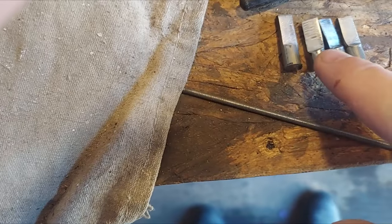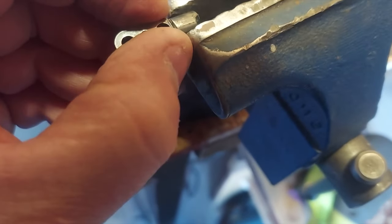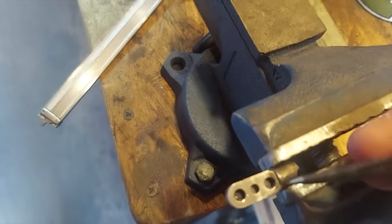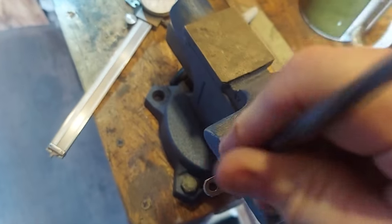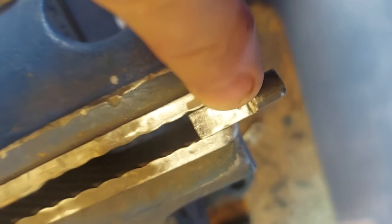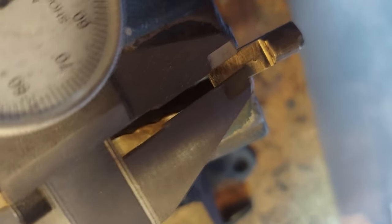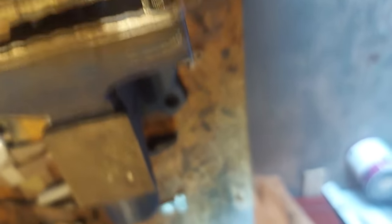There are four matching pieces, pretty good. Now I need to drill the holes. I stick one of the plates on there as tight as I can, then use this punch — a really hard piece of sharp metal — and center it in there to make a hole, then hit it with a hammer. This gives me a nice little divot for my bit to grab onto so it won't walk all over the place. Then I take my calipers and just run them across there — that leaves a nice little scratch so I know where the second hole needs to be.